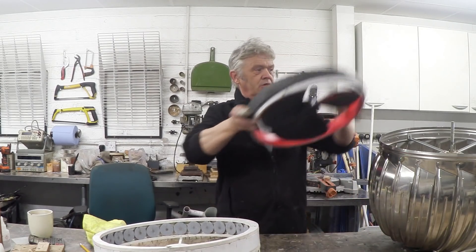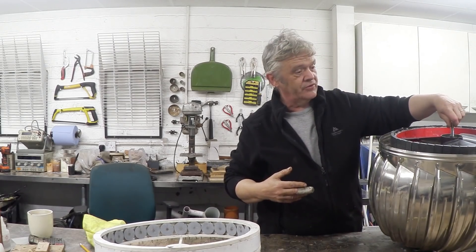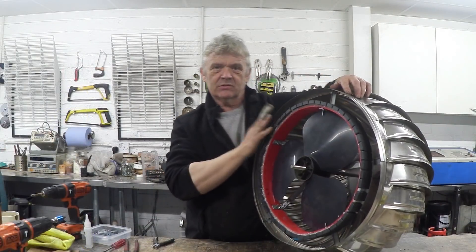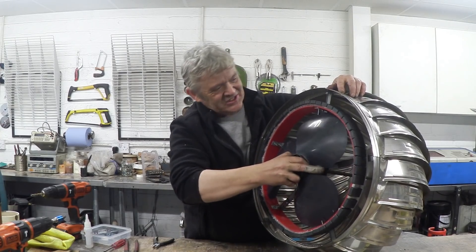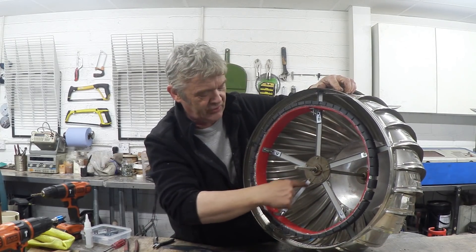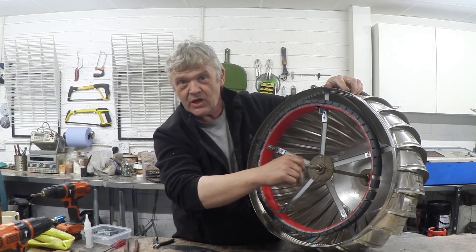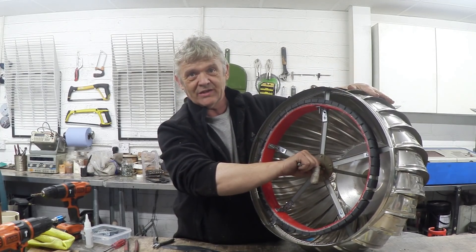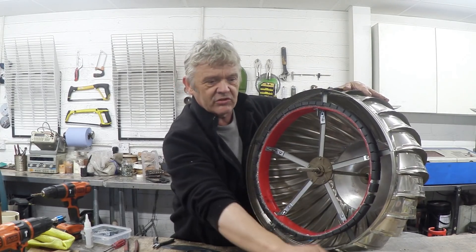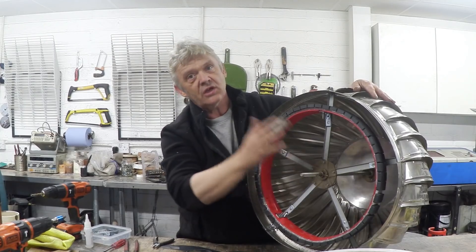To fix this in, we drill it out so that it's free to spin on that central axle, or equally the axle is free to spin through that. Then we mark it up and fix it to the stairs. The central ring is attached to the stairs using these angle brackets, which means that bar is still free to rotate. When we fix that bar to the base and the wind catches this - or the thermal updraft catches it - it will rotate, rotating the ring.